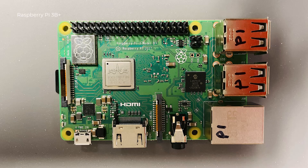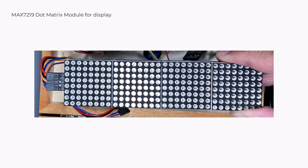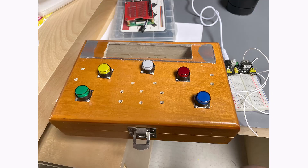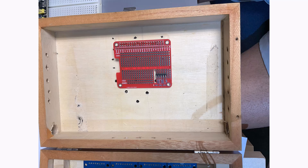Let's talk about what hardware we need to build this game. One Raspberry Pi board. Five momentary LED buttons. Max 7219 dot matrix module for display. A wooden box to house the game. 26 AWG stranded wires. And a breakout board which will connect all the wires to the Raspberry Pi.